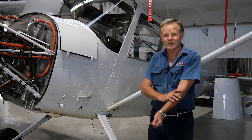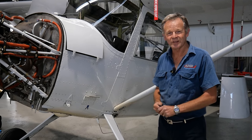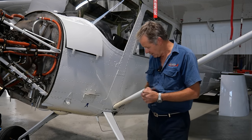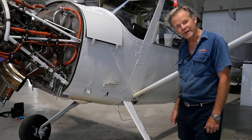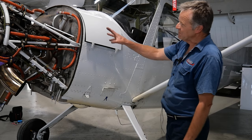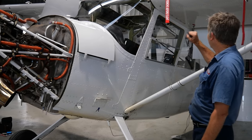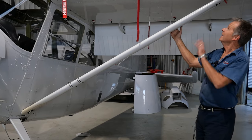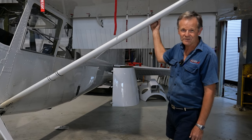In the 100-hourly inspection we're looking at general airframe condition — checking for working rivets, any cracks in the skins, or corrosion in the airframe. We check the undercarriage, jack the aeroplane, take the wheels off and grease the wheel bearings, check brake linings and all hydraulic piping to the brakes. We also check the engine mount frame, run through the engine completely pulling all the filters. Airframe-wise, we pull all the panels from the wing and around the airframe and inspect with a torch and mirror, looking for corrosion, working hardware, and any cracks.